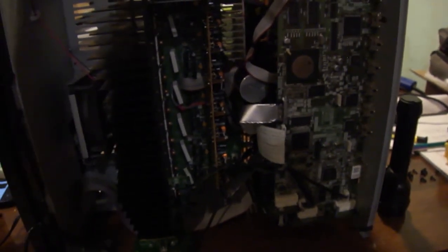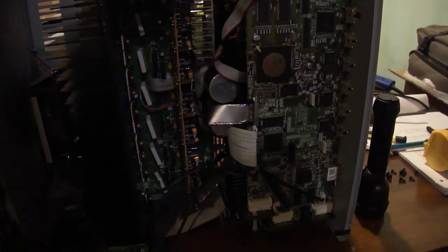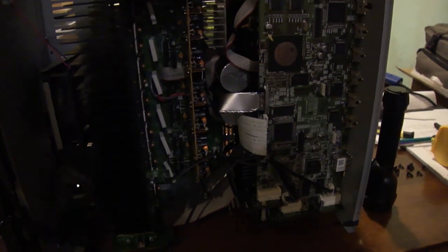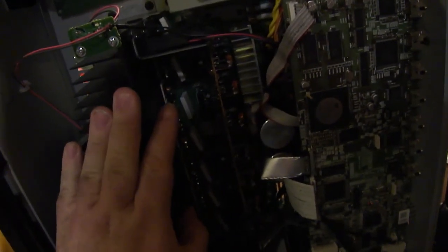But that's a simple troubleshooting video on how you can try to narrow down potentially where the fault may lie. Like I said, you didn't see me do it in the video, but the first step I would normally do, if this receiver would have been 20 plus years old, is check the amplifier stages, because 9 times out of 10 they would be shorted or blown. But since this thing is modern, it's less likely this and more likely that nowadays.